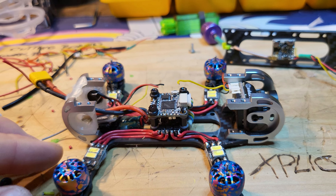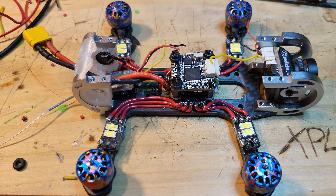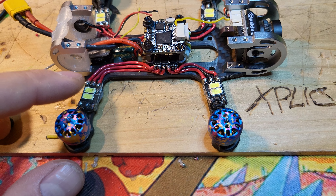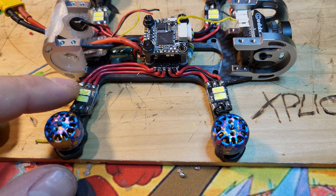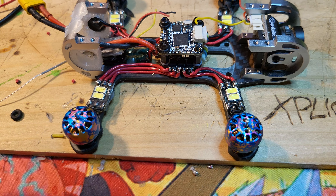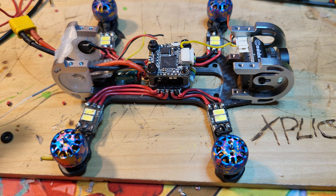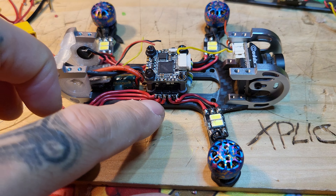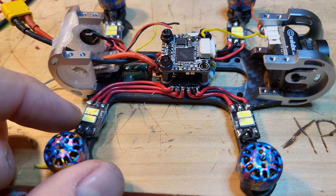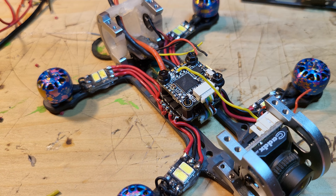I've already done the motors. I do the race lights frame wiring — that's new. I recommend using race lights even on something as small as this. What this gives you the option to do, especially if you're a new builder, is handle things like a cold solder or a motor going bad. Let's say one breaks off — you've only got to mess with that one connection. Let's say the motor goes — that's a little more complicated of a fix, especially if you've got the prop guard and all that jammed on there.